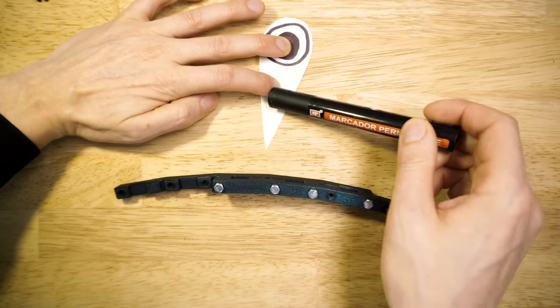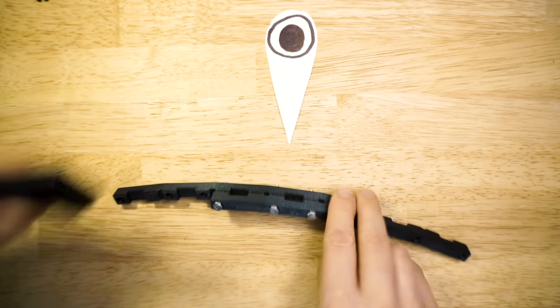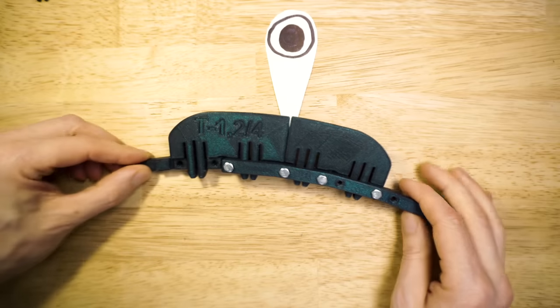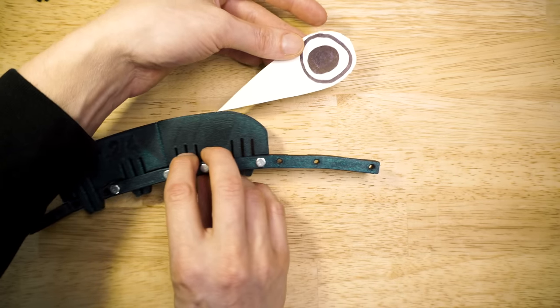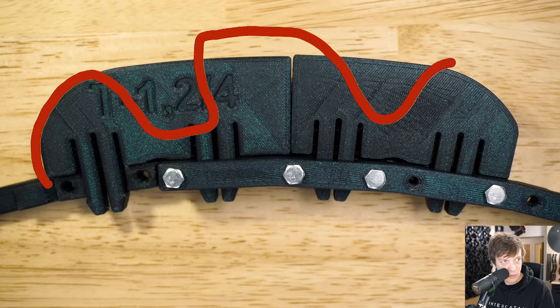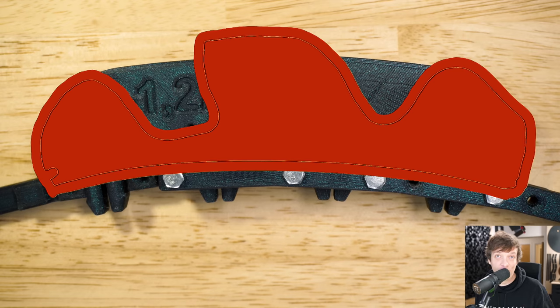So now we can take the principle from the Japanese automata, combine it with the musical expression of opening and closing the hi-hat, and we can program that with our programming profiles. So instead of connecting this reader to a marble gate, we can connect it to a Bowden cable that opens and closes the hi-hat. And then we can create any kind of profile we want. And we can put them in, for example, like this, and have actually a programmable cam disc. So when the programming wheel comes here, the hi-hat is closed, the hi-hat is opened, and it rides on it, the hi-hat is closed. We can go like this, but we can also go like this, we can go like this, probably not, but we can do any waveform we actually want on top of this. So this then will be the programming profile, something like that.